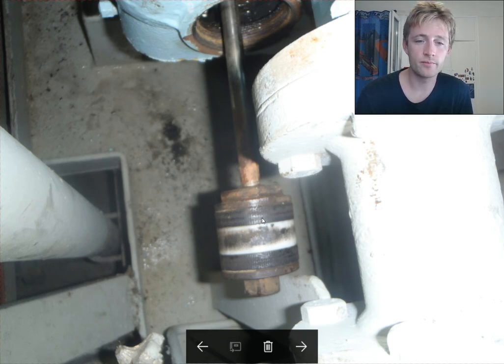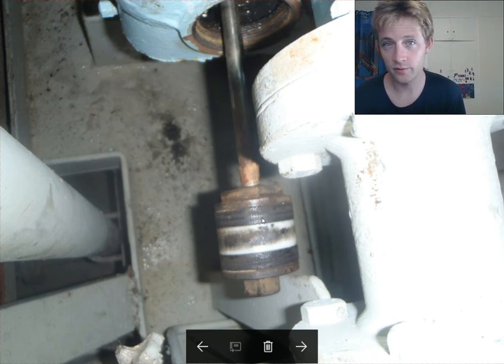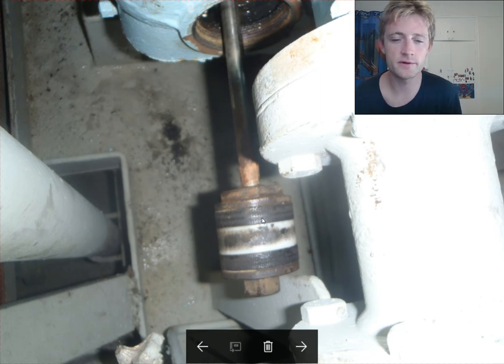Another common problem on this kind of pump is blocked filters. Also, dry running is a problem, and maybe there is air trapped — after cleaning the filter, there is always air trapped inside on the filter side, so be careful. Always check that the suction and discharge valves are open before operating.